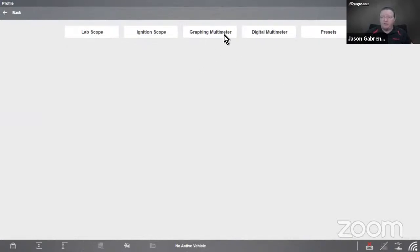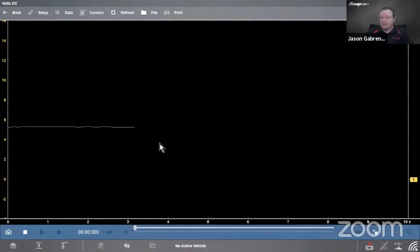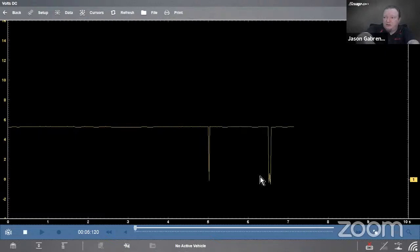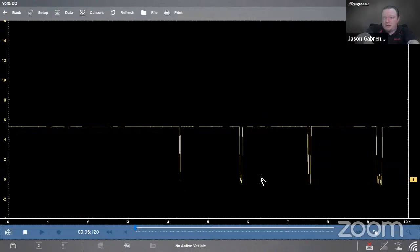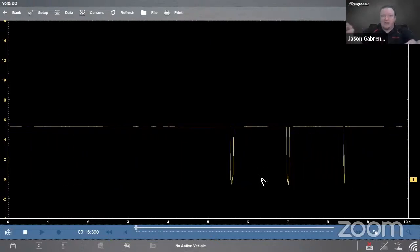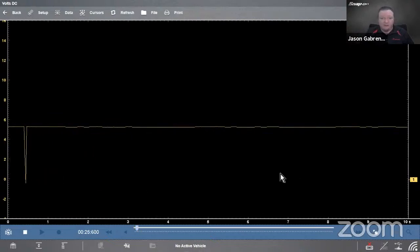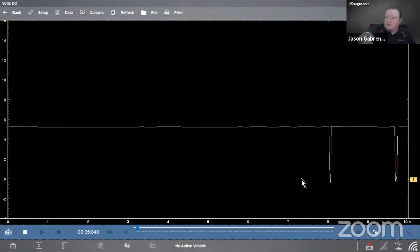If we want to go a little bit faster we get to a graphing multimeter. It takes those digital volt numbers and graphs them over a period of time. Going to volts DC on a graphing meter, we can see the signal come across the screen, and if I drop it out you can see those dropouts much more clearly — maybe about five volts going in, then it just drops out every time I disconnect. The sample rate here is a 10-second window, still not as fast as a scope, but good for catching quick glitches if they're long enough.